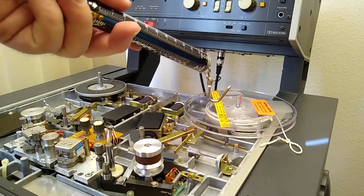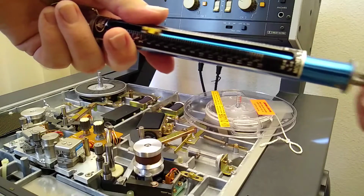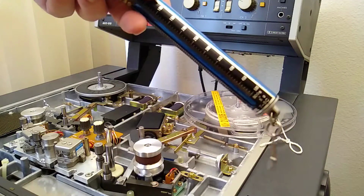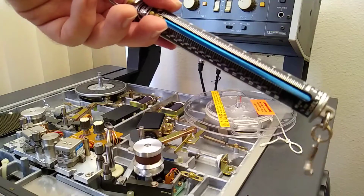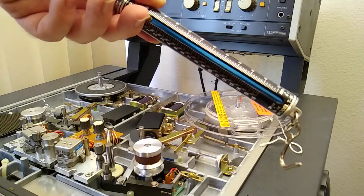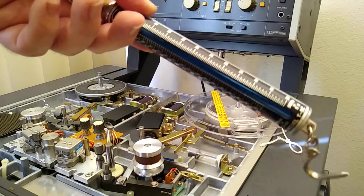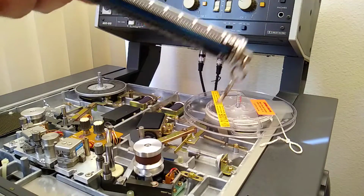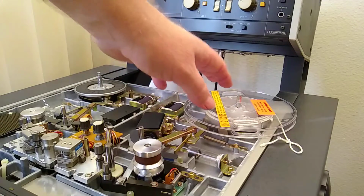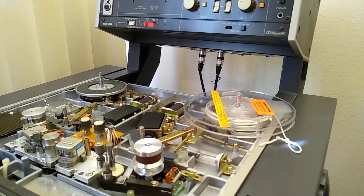I'll be honest and say that's very much open to interpretation. These spring scales are just too unreliable to actually get a good reading on. And just in case you're wondering, I did calibrate this. I used a digital postal scale that's very accurate, and found exactly 280 grams, and then checked this with it, and it measured up exactly 280. So this is calibrated. But I did get this close. It's coming out between 280, 300. It does get hung a bit and goes up to like 350, but you're not going to be able to get it closer than that, I don't think. It's somewhat open to interpretation.